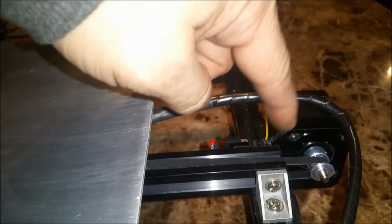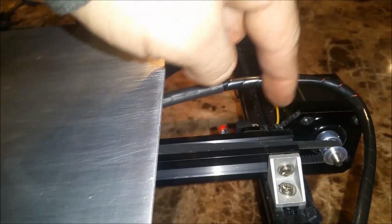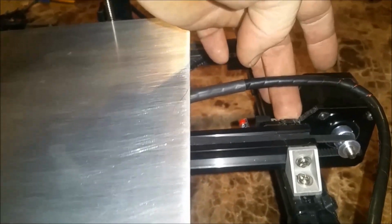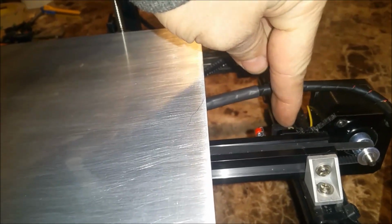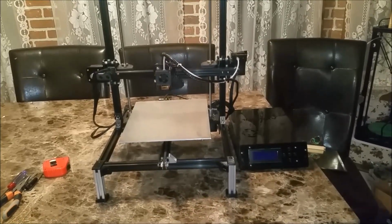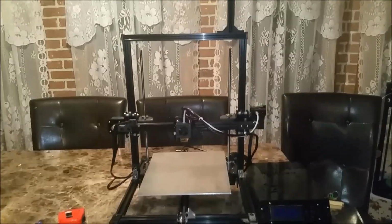It's still not my goal yet, but maybe a redesign of this bracket, print a new one out, and then I could maybe instead of mounting it here, mount it on here, right? Just a bracket there, mount this here, and still has the same effect, and then I could have the same bracket mount this back here, right? And then the switch, I can't mount the switch farther back than here. This switch would have to be triggered right about there, or else I end up hitting this anyway. The next step in this now is modify the firmware and set my new limits for my X and Y axis. I'm probably going to set a limit for my Z axis so I don't by mistake forget that and pop off the top.